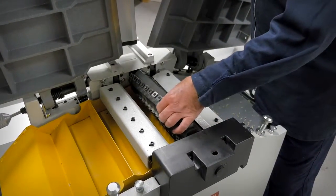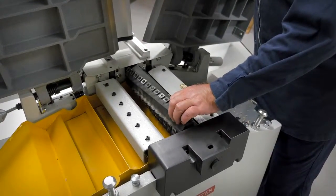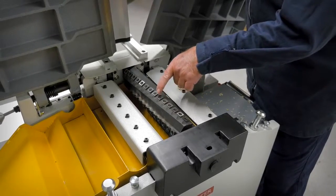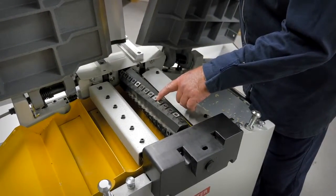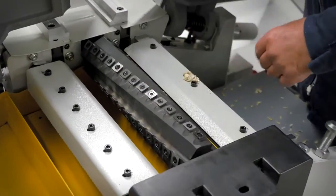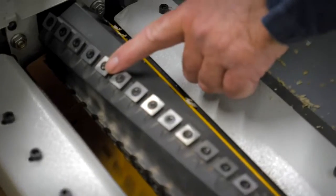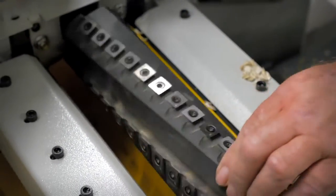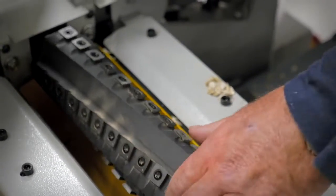Each edge will have the life of roughly 20 high speed steel knives, either sharpenings or fresh knives. But if you nick one of these little blades, or find they're all getting rather blunt after a long period of use, they have four edges so you can just undo the central torx head screw and there's a little marker so you can just revolve each cutter to a fresh place. So in total you could say this whole set of knives is equivalent to about 80 sets of high speed steel knives.